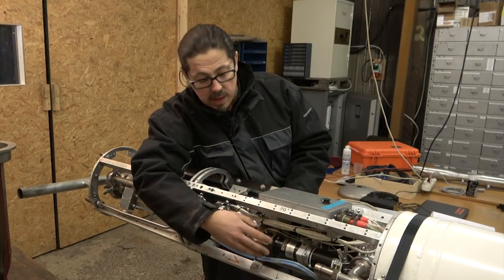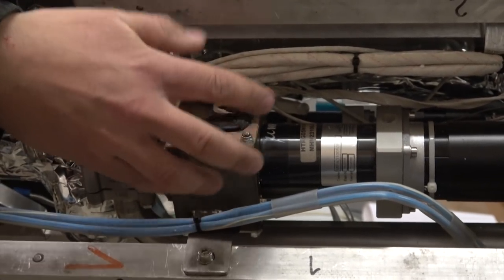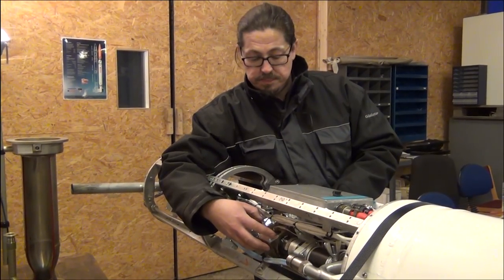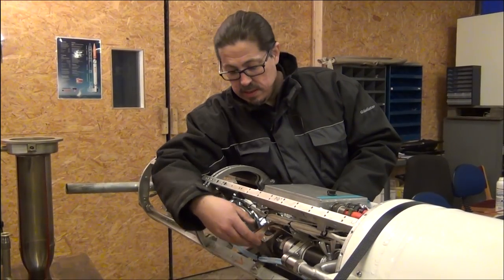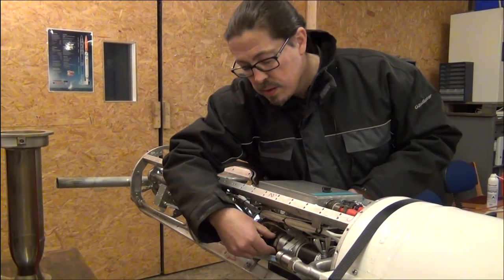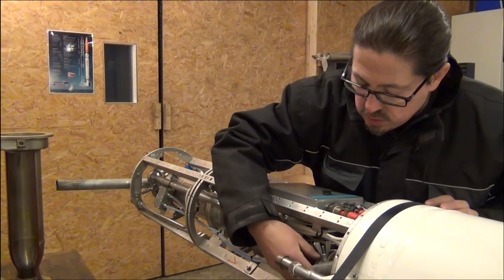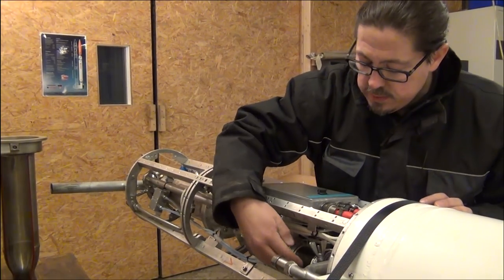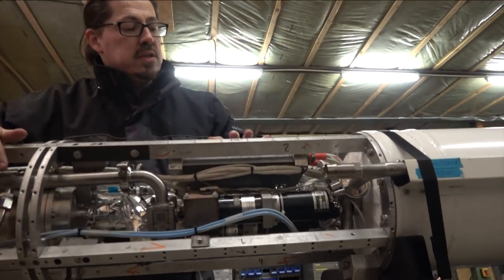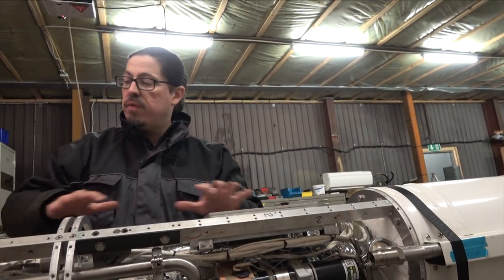If we move down a little bit further, you can see on each side our two main valves. These are the valves that control the fuel flow to the engine — one controls the flow of ethanol and the other one the flow of liquid oxygen. The gearboxes that you see here are actually something that we have custom made to fit onto the gearboxes that come from the manufacturer, and then we have the motor itself up here. These motors are digitally controlled so that the engine controller can send them commands, and then they can open and close at very small angles so we can control the flow very efficiently to the engine.